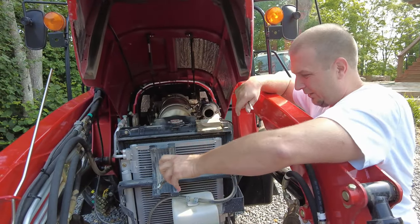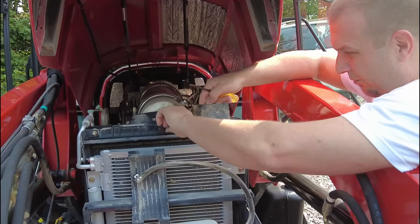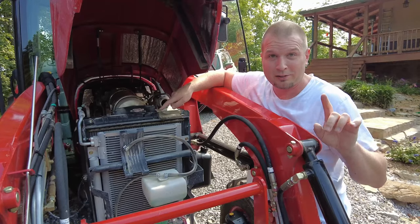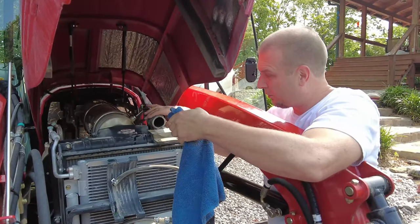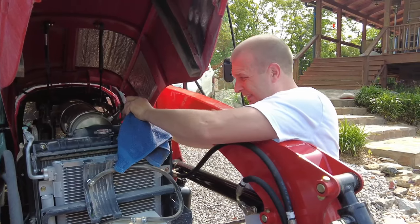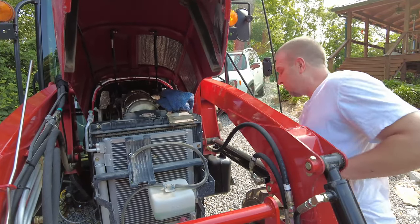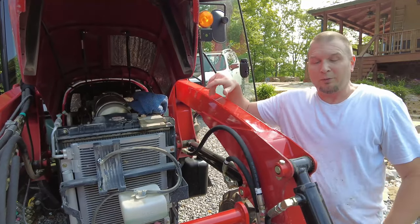This is the overflow for the radiator, so we can just get that out of the way. Now these little flaps will flip up to access the radiator screen. You should put a rag in this before you pull out the screen because if it's full of grass it's going to go all over the place — I think it's a horrible design to put that there. Put a rag in the hole and now I can get the air compressor and blow out the underside of the engine.